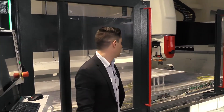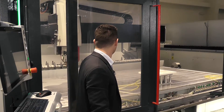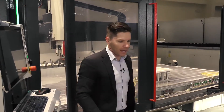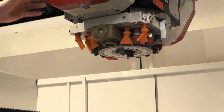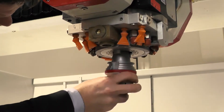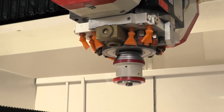Now we can see exactly the tool that's in the machine and I'm going to tell it to automatic change with no tool in it. The tools will start uploading and now the machine knows exactly where each tool is. You can still see we have a little bit of a shine on that tool — not too much where it's dripping. Check the rotation.